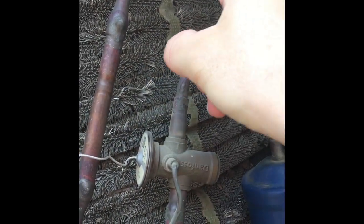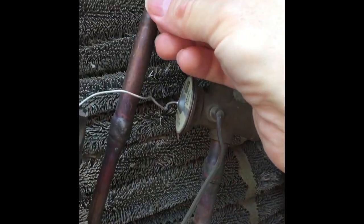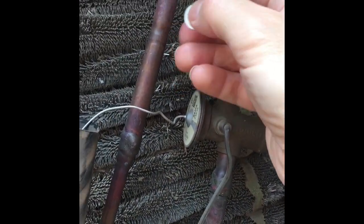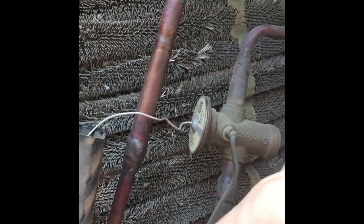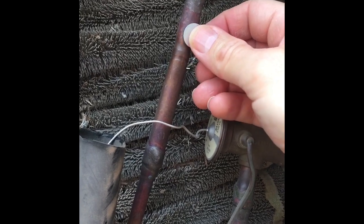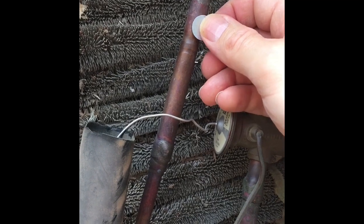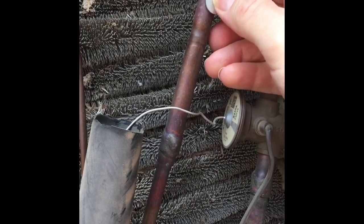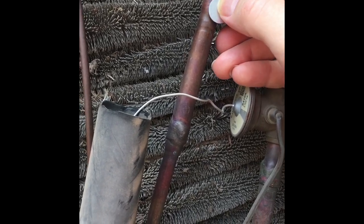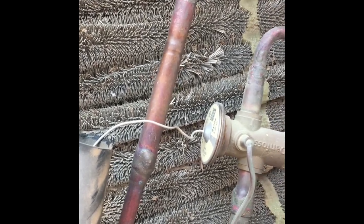I don't think this is causing any harm because I think the refrigerant is maybe just coming back down, going into the condenser unit — could be wrong obviously. But apparently Trane sells a magnet kit that you can clip on to this to keep this check valve from vibrating and chattering. But then again, I don't know if that would keep the check valve ball from doing its job and sliding up and down — maybe it's seated.